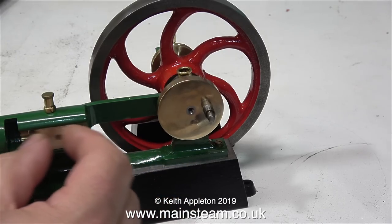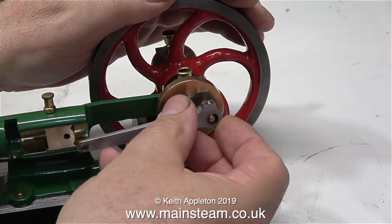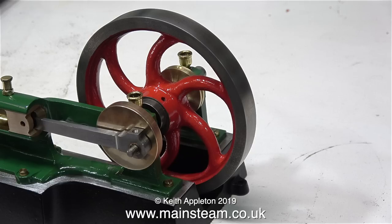I'm pleased with this because I redesigned the crosshead. Normally crossheads are flat on both sides, but this one isn't — it's only flat on the front. I left the back of the crosshead at the same diameter as the trunk guide. This means the crosshead is a really good fit in the guide and doesn't move about at all, well apart from backwards and forwards obviously.